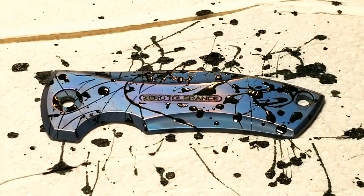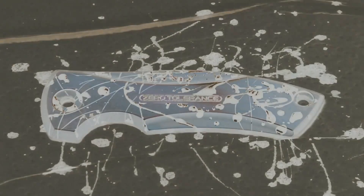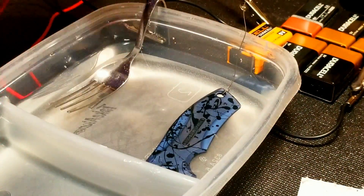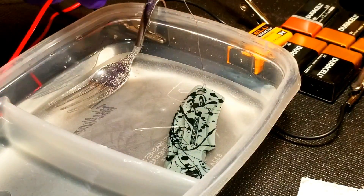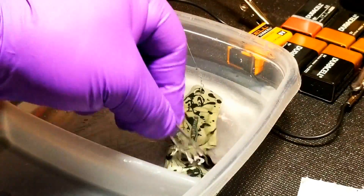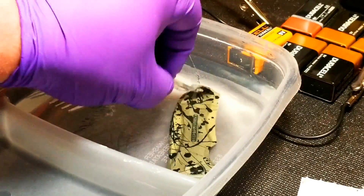This is my piece ready to be anodized after I've pulled the tape off. At this point it can go into the anodizing bath. The next step is to connect the batteries and leads. I'm aiming for a gold color so I'm using six nine-volt batteries. Positive goes to the piece you're anodizing, negative goes to the piece in the bath already.